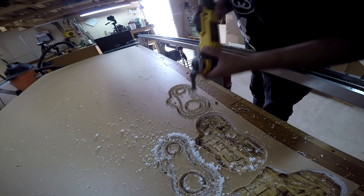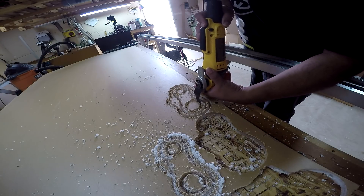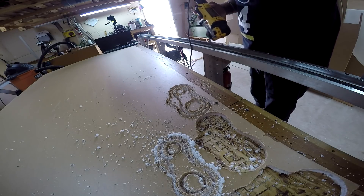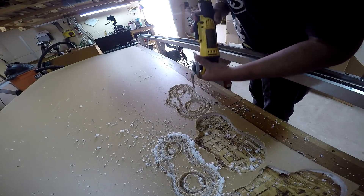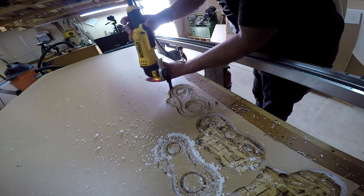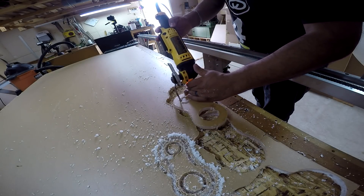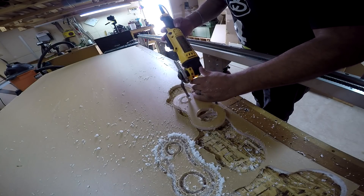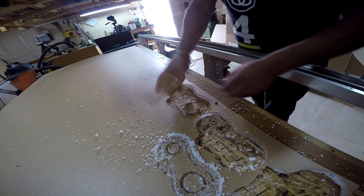So we use the same holding tabs and cut it out with our multi-tool. Depending on the diameter of the circle, two holding tabs is just enough. The number of holding tabs depends on the size of the tabs themselves, and also on the geometry of the part — if there's a lot of jut-outs and complex geometry you want more holding tabs to reduce vibration in those sections.